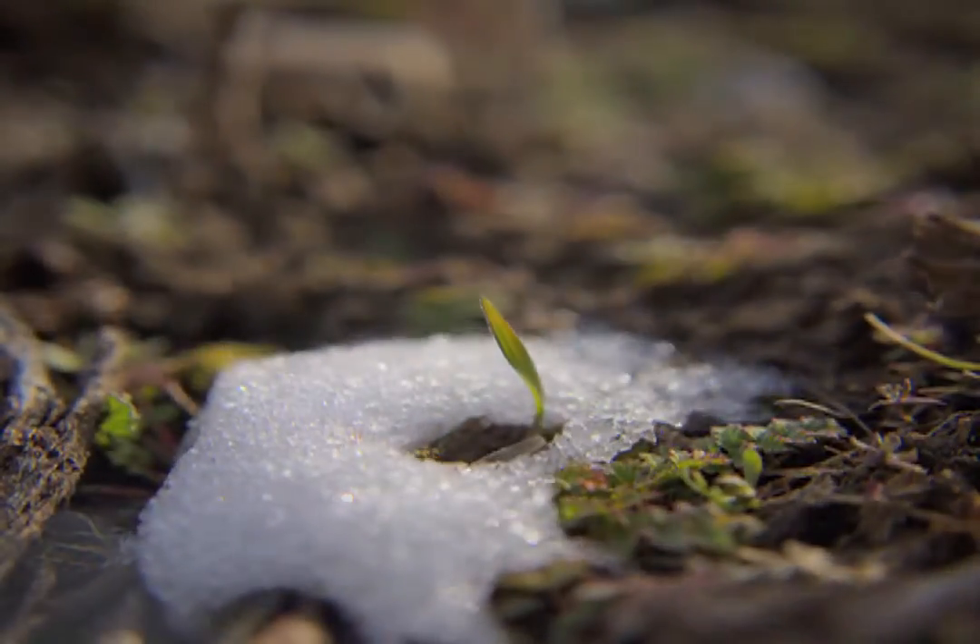The problem here is hiding beneath the painted surface. This coat of paint may now be the only thing that is actually holding the bricks together. Any moisture that is trapped inside the bricks will begin to expand with every freeze-thaw cycle that we experience.